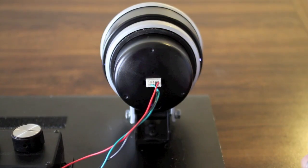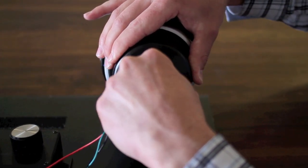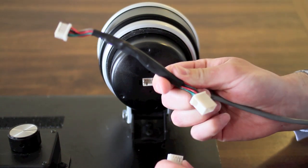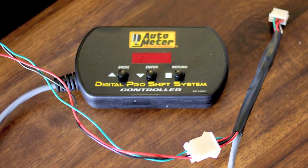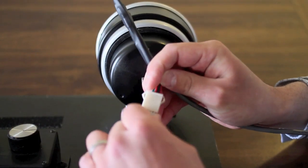In order to connect your PIC controller into your tach, the first thing you need to do is unplug the power harness that is installed in the back of your tach. Then you are going to plug the power harness into the PIC wire harness and also the PIC harness into the back of the tach.